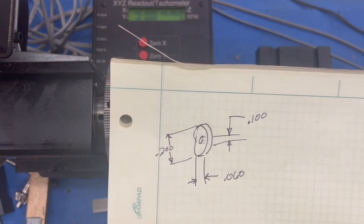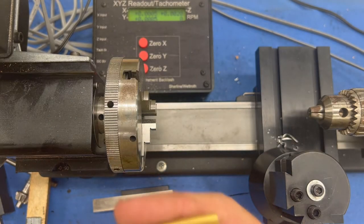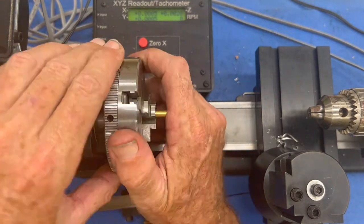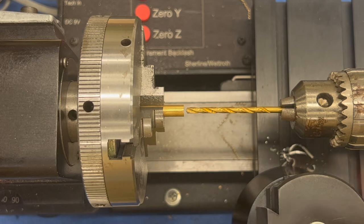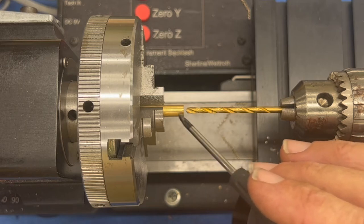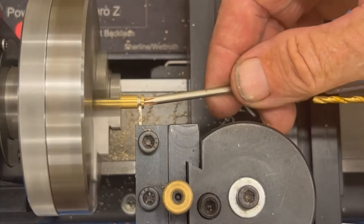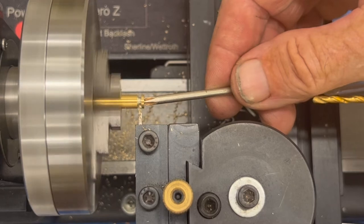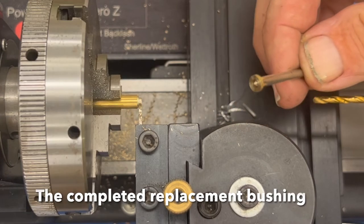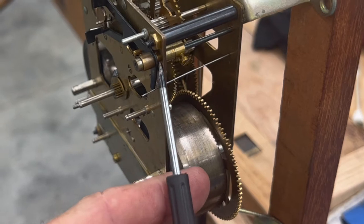It's going to be about 200 thousandths in diameter. I have some spare brass stock that I use, so we're going to make it out of that. We're going to drill a 96-thousandths hole in this — this will be the bushing we're making out of this piece right here. There's the new spacer that I cut — the new bushing.